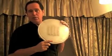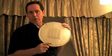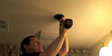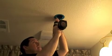It comes in many different sizes. This particular size is the 2200, which means it has 2200 lumens. First thing you want to do is remove the protective plastic wrap, then take off the dome. On the inside is a special disc which holds a special patented lighting system — we'll set that aside. It has universal mounting holes which allow you to first put the screws in the box and then the fixture simply slides around and you secure it.